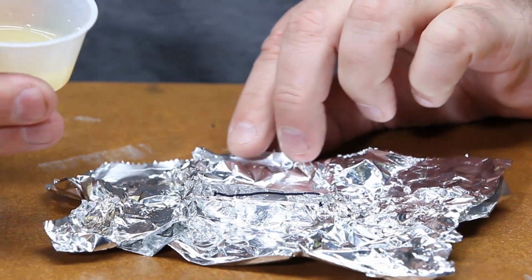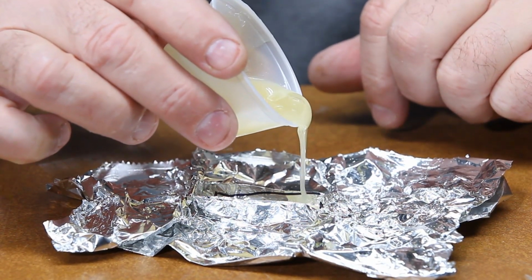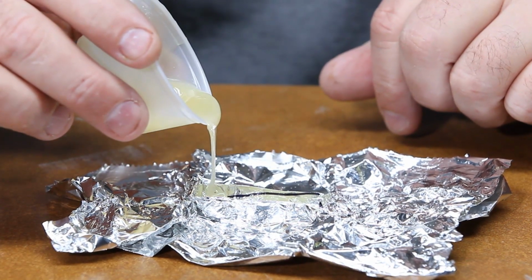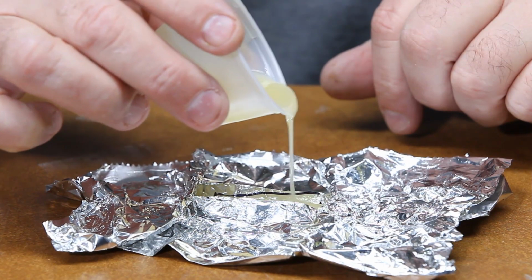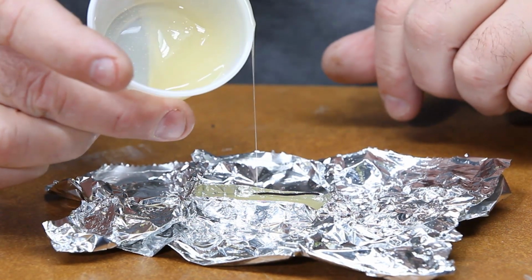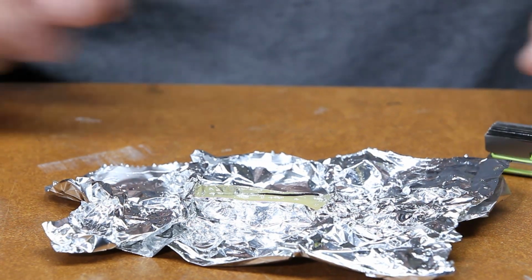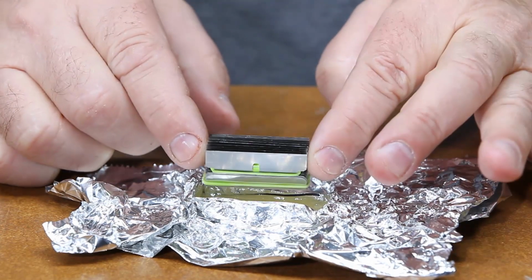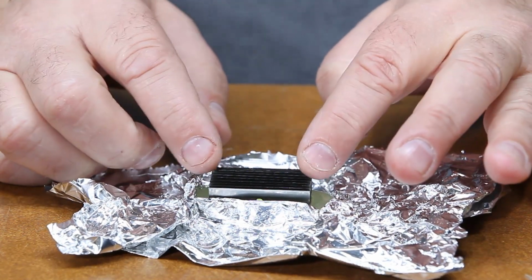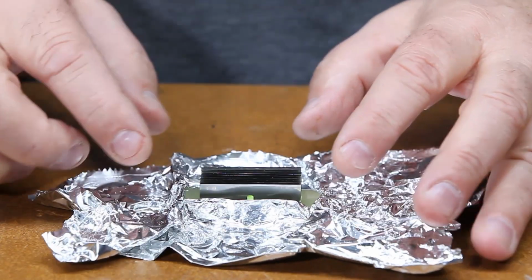We're going to take our form, and we're just going to pour it about half to 2/3 of the way full. Now, I said I heated this epoxy, and that's important, especially if you're in a cold environment. You want epoxy that's warm because it will flow better, and in this case we want it to flow around all of our blades. And we're just going to set this right in there, and we want that epoxy to flow in all around them to hold them in place.